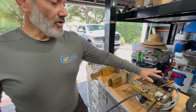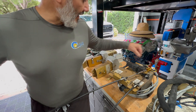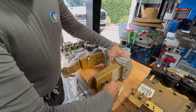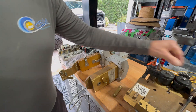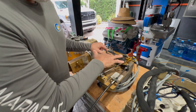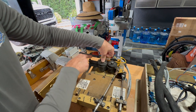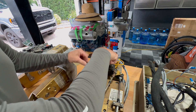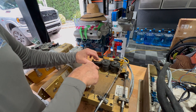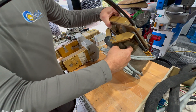Every time the actuator moves, you're moving the mechanical backup. No matter what — you take this handle and move it, these handles will move, and it's going to be moving this. Make sure all the moving components are free. Push the pin in when it's centered and just move it — see if it's free. If it's tight, you probably need a little bit of cleaning inside there.